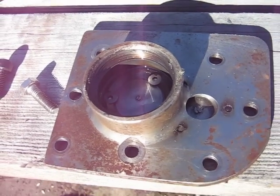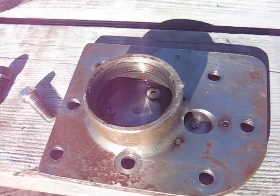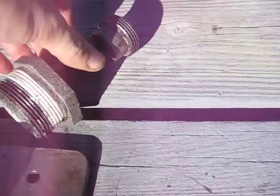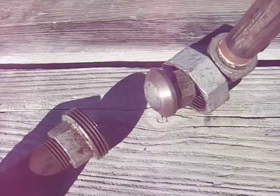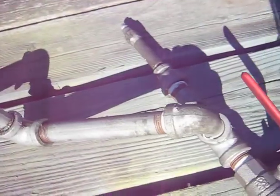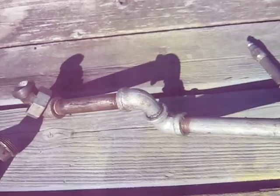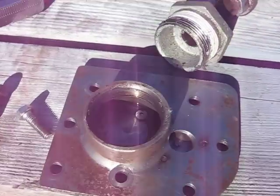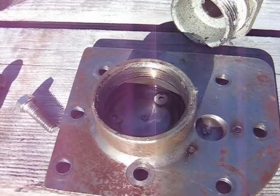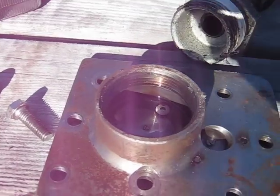It worked really well — I ran it at least 10 hours, probably longer, doing sandblasting and things. Anyway, I put a connector on there so I could take the piping off, and ran the piping over to a ball valve setup. The main reason I ended up with so much piping was it got really hot and actually blew a compressed air hose apart one time, so I put more steel pipes on there to cool the discharge air down a bit. Anyway, hope that helps out.